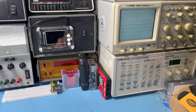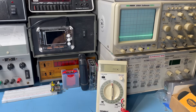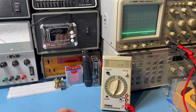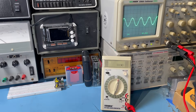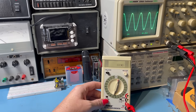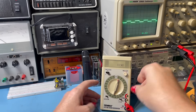You can see the scope now. I'm going to pop some test leads in here, put an adapter on there and plug my banana plugs in. So we're on - technically we're on. Let's turn our amplitude up - yeah, we've got something. Adjust my time base - okay, that's not bad. So we can change our amplitude. It's pretty stable, it's not wobbling about - it's not bad for such a little device. So we've got sine or square - there's our square wave. We've got attenuation here - that's on zero, and we've got minus 20 dBs.